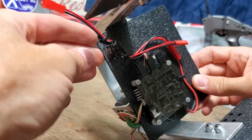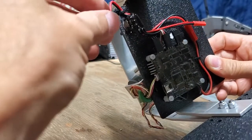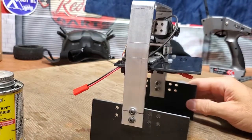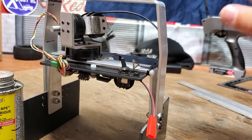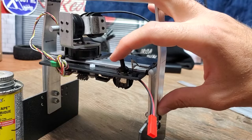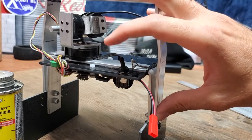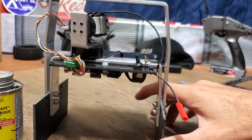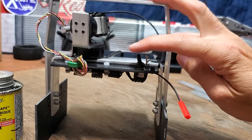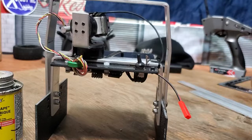This is the power wire, so I've got to connect and disconnect it whenever I put the gimbal on or off — I don't want to be pulling on it and have it tug against the switch, because that'll just kill it eventually. This is the power switch for the gimbal and the FPV transmitter. Those transmitters can consume a fair bit of power, so when I hit low voltage cutoff I want this handy so I can just switch off the VTX and not run my batteries down too much. Also, if I crash really bad, the gimbal just needs a big reset — I power cycle the whole thing. I keep the ESC switch handy too so I can access all of them with the body on.